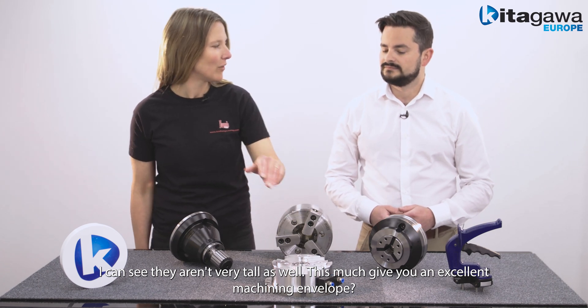The 6 inch cylinder has an overall height of just 72 millimetres. So are they hydraulic or pneumatically actuated? Well, both or either. The 10 inch cylinder can deliver up to 51 kilonewtons of pull force using hydraulics and has a stroke of 20 millimetres. This is easily enough to operate a 10 inch chuck.